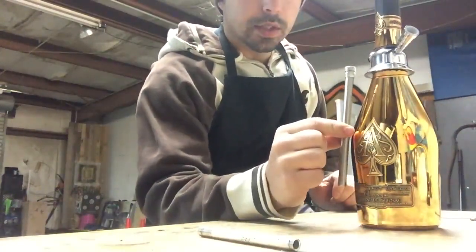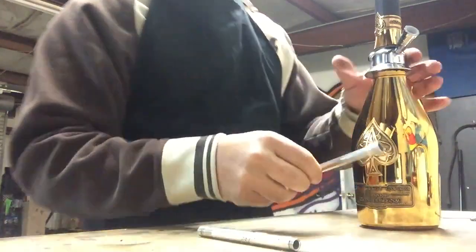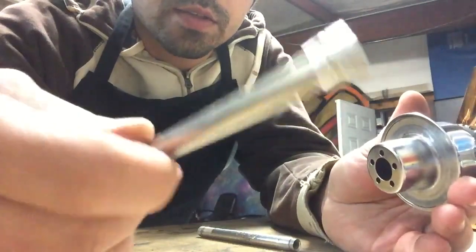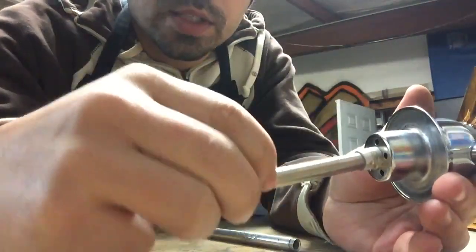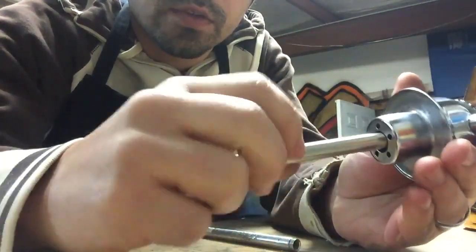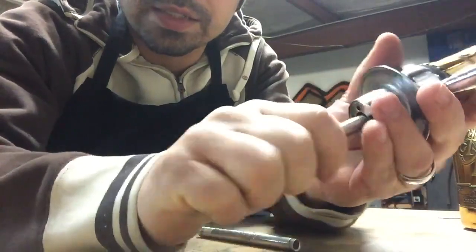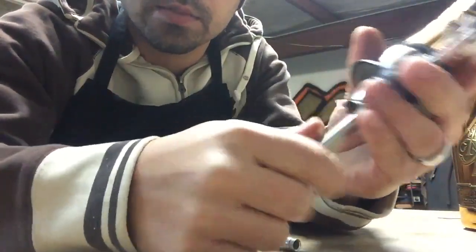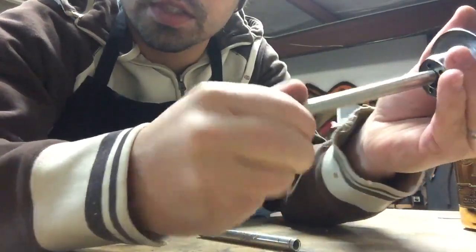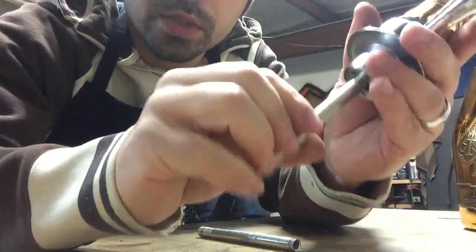The finished stem should be much longer than the original, sticking down to where that bottom label is — that's our goal. The way this goes together: it's threaded, so it goes into the hole and you feel the threading of that original stem that came through the top of the valve body. A lot of people over-tighten these — do not over-tighten. Just tighten very loosely until snug. You should only have to apply a little bit of torque to get it undone. Right when it's snug, stop turning.